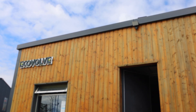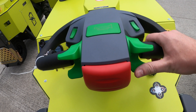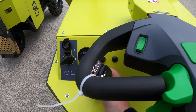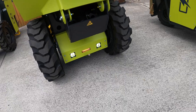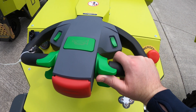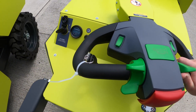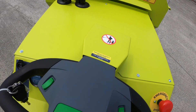I'll bring the other camera with me so you can see it. Once you step up you can engage the higher speed if you want, but you've got this dead man's handle, the emergency brake, the regular horn, and then whether it's fast or slow, and whether you want the lights on or not. Let's turn on all the lights so you can see what's happening — this is for dark areas, and you also have your beacons either side, and your beacons and lights down the front as well. So that's reverse, and then forward is up.